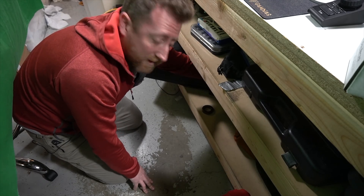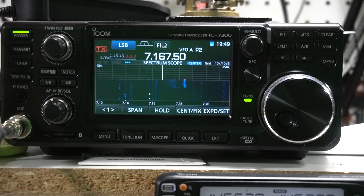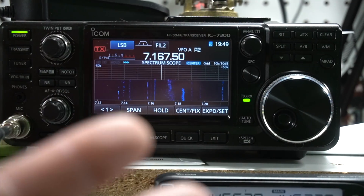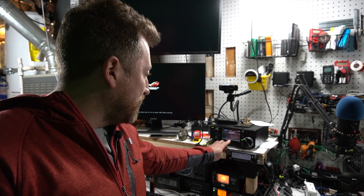So I attempted to use a snap-on ferrite — it didn't work. So we're going to try a couple of wraps with the toroid core if I can, because the cable is not really that long. Let's see if three turns did it. There's some still picking it up. So we've got three turns through the center of the toroid. One more will probably knock it out, but I don't have the space necessary. Sadly, I don't have the length of cable long enough to wrap a couple extra turns. That's okay — that's a livable amount of hash. I can buy a longer power cord and loop it a couple more times to effectively nullify the noise.